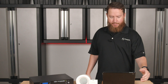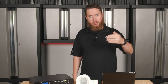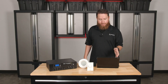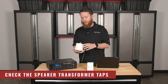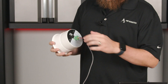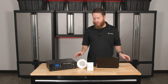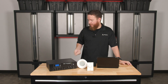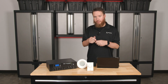It's also a good idea at that point to be listening. If we're hearing a buzz or rattling on a particular speaker, we want to listen individually to those speakers to see — does the issue persist for all of them or just an individual speaker? At that point, we also want to double check the transformer taps. There is a dial on the back of most 70 volt speakers, or it may be color-coded leads, that determines how much wattage the speaker is actually getting. By checking that, we may be able to determine why a speaker is quiet — is it getting the right amount of wattage? If not, you may need to adjust the transformer tap on that speaker, or connect the correct multicolored lead.